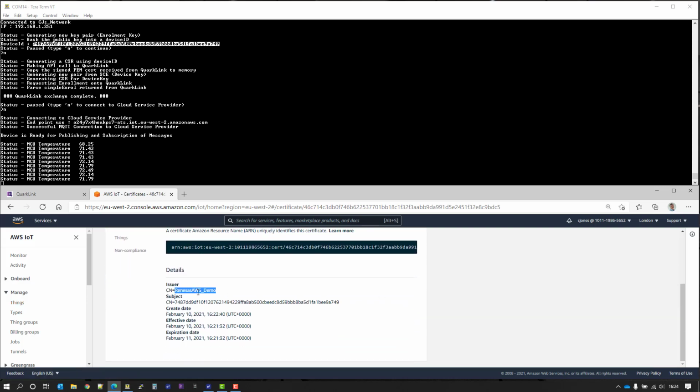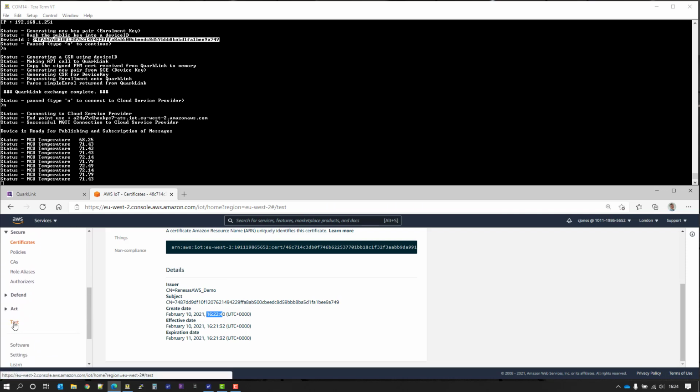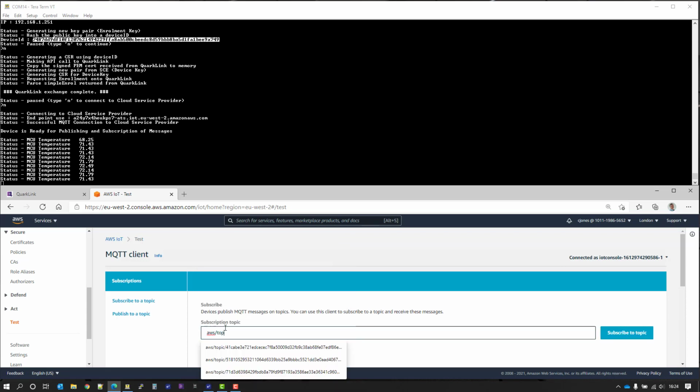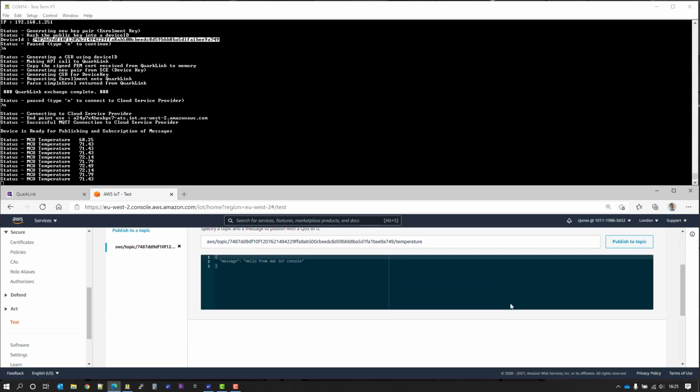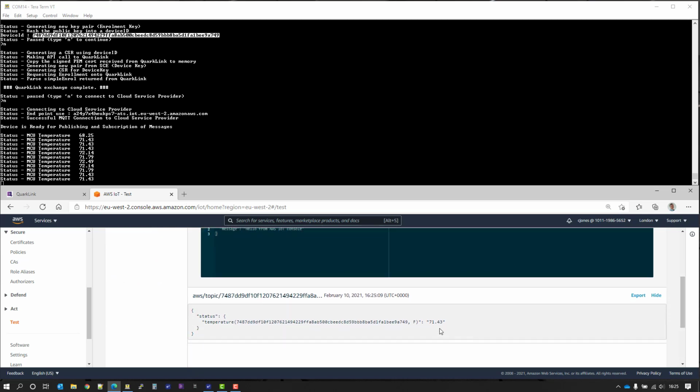You can see the Renesas demo, you can see the identity is the same, and you can see that the certificate was recently generated. In fact, a few minutes earlier. You can see on my clock down here, it's 2 minutes ago. So let's see if we can actually see the data being sent. So I'm going to subscribe to a topic, which is of this device, my identity of course, and it's going to be temperature. So if I subscribe and look on the console, up here you'll see a temperature of 71.43 was sent, and down here at AWS it received the temperature correctly.